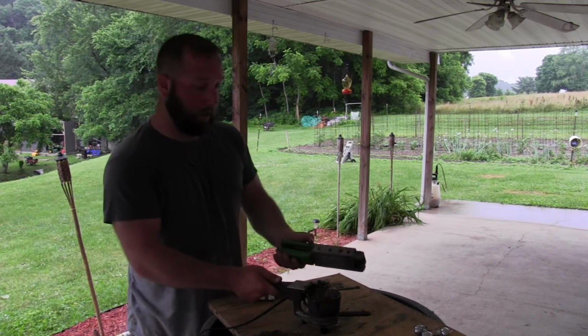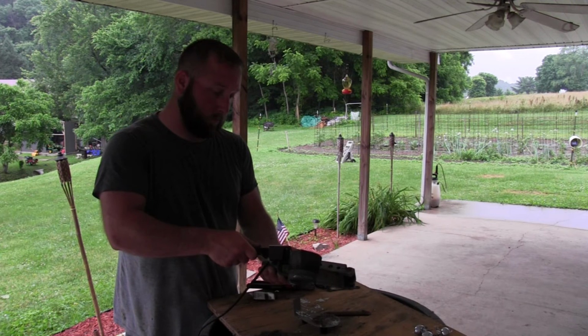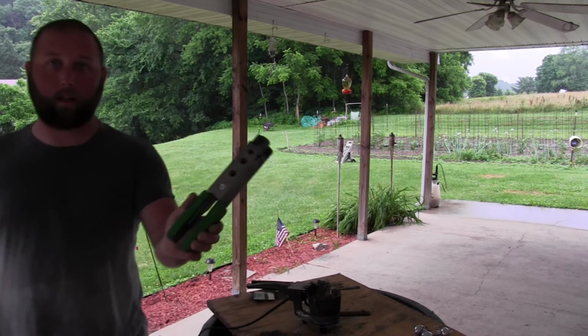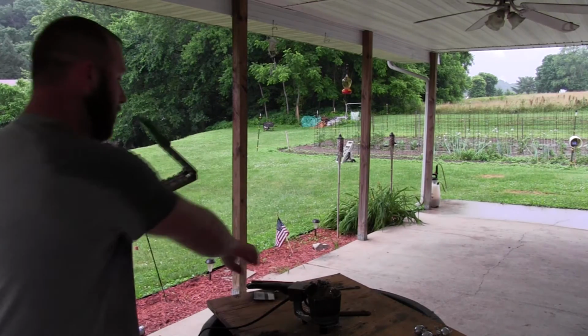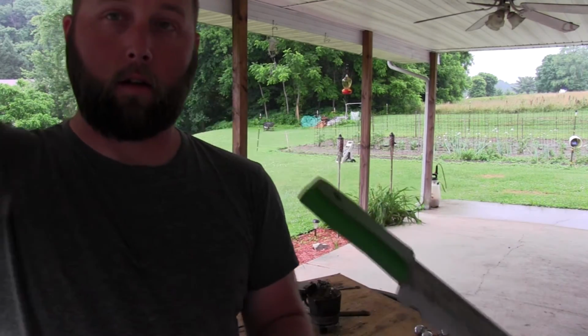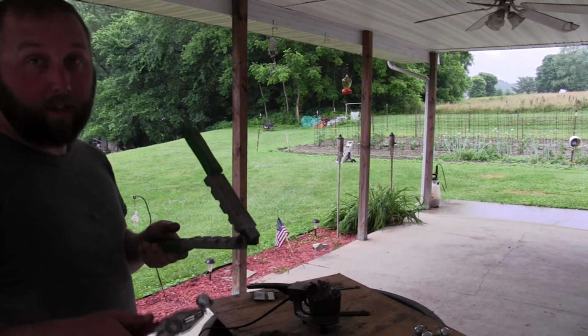Alright, so again, I'm going to take some lead, pour it into the 3 ounce mold, till it fills to the top. Again, I have a little bit of sprue there on that one. You can unmold these things almost immediately, but again, they are extremely hot. But knock the sprue off from it, save yourself thousands of dollars, guys.